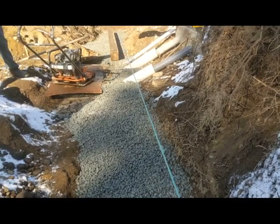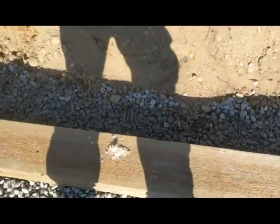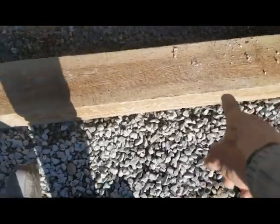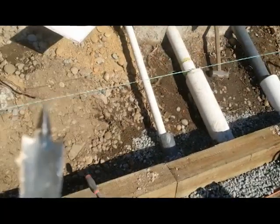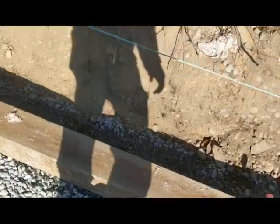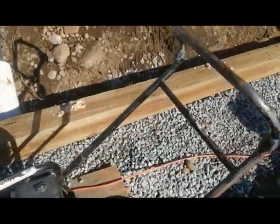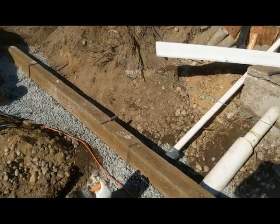I'll keep you updated as we go. Yeah my friends, here on my retaining wall, I'm just putting a four-foot rebar, stopping on this first six by six. Like you guys can see, my holes are about three feet apart, because there's gonna be a lot of pressure on this wall. I'm drilling with a five-eighths drill bit and putting a three-quarter inch rebar — that way it goes nice and tight and doesn't move. We align it, we level it, we prepare everything, and now we put the rebar down. Usually I do four to five feet, but in this case the wall is gonna be quite a bit high, about 42 to 48 inches, so we're putting some extra rebar that way the thing holds nice and tight.